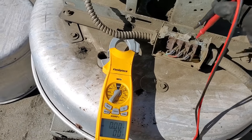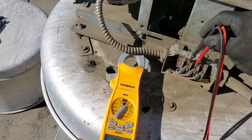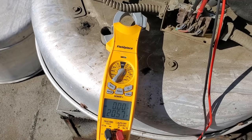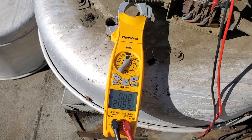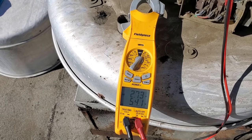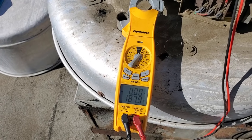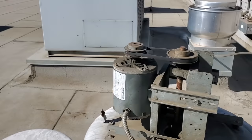I know this restaurant's not 480 volts, but I'm pretty confident it's going to be a 208-volt circuit. Yeah, measuring 205 volts across all legs — so we've got proper voltage, proper power.